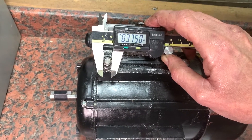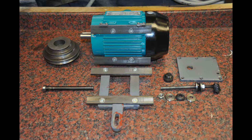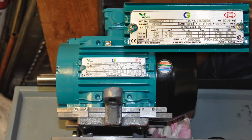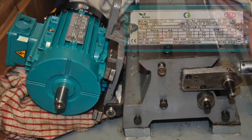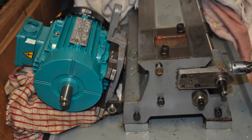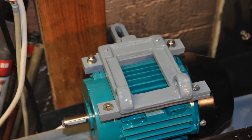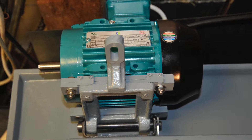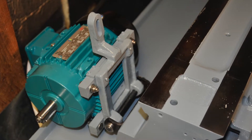I adapted a metric mount motor and bored out the pulley for a larger motor shaft. To adapt the footprint to the mount frame, mild steel runners were made for the frame and for the motor, and they were mounted at the same gauge. I added little wings to the top rail of the motor so I could slide it fore and aft before committing to the final position. When I got to the sweet spot we drilled it through and permanently bolted it in place — bolts at the top, machine screws at the bottom for clearance. But ideally just buy a bog standard motor with the same footprint and same output shaft — plenty out there, make life easy.